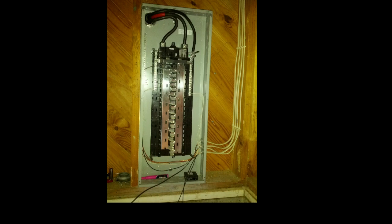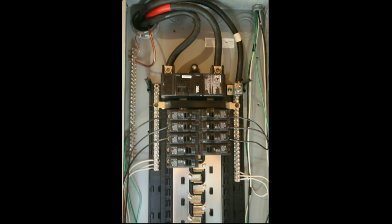Once that's done, you can see here I start running my romex into the box - you want to keep this as neat as possible. I'm strapping my cables down to the wall, keeping it neat, and that's the exit at the top out to the ceiling. I'm drilling holes to keep that neat and keep track of what wires are going where. Here's a better look inside the box as wires are being run to it. All of these breakers here are single-pole breakers, so they're 110 volt circuits, single space.